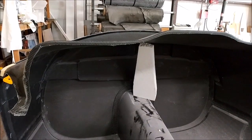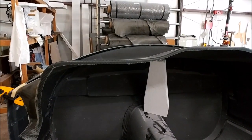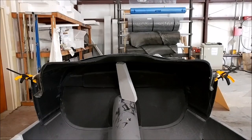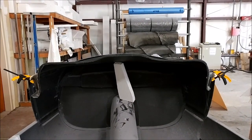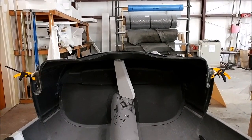There's just a bit of foam holding it up at the back and some clamps on the side. The part came out at six pounds and we decided we laid it up too heavy, so we're going to redo it at about half the thickness — it's just too strong and doesn't need to be that heavy. But it looks good.